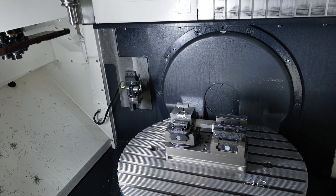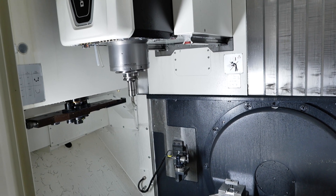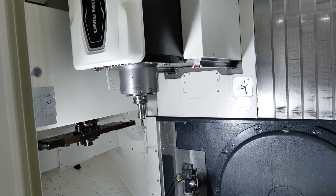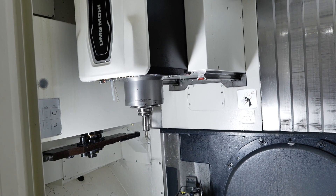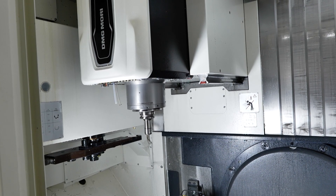What I love about this machine is it's got a great spindle — 15,000 RPM as an option and 121 Newton metres of torque, so it's a great all-rounder. We can cut aluminium with the 15,000 RPM and cut in harder materials with 121 Newton metres of torque.